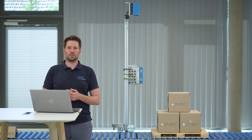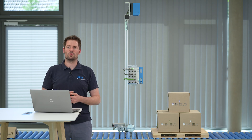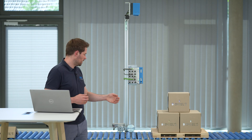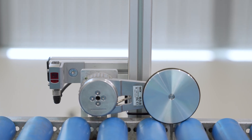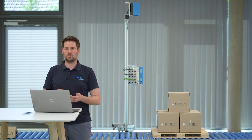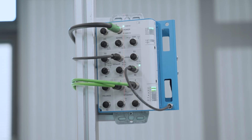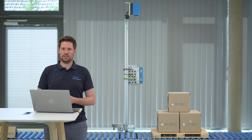As a result, you get the width and height profile of the object exactly where the laser line of the sensor is visible. To capture a full 3D image of the object, it needs to move past the sensor and many profiles need to be recorded. For higher scan quality, the spacing between these profiles needs to be equal. An encoder connected to the LMS4000 provides this information independent of conveyor speed or acceleration. The LMS4000 is connected to the Ethernet port 2 of the sensor integration machine SIM2000. This edge computing device captures the single profiles and assembles them into a full 3D profile.